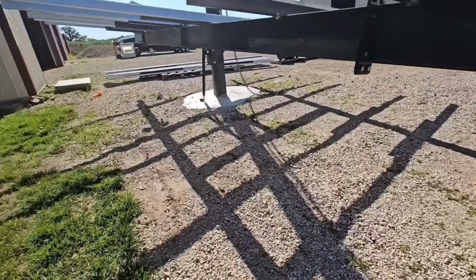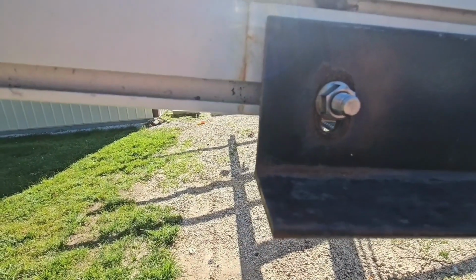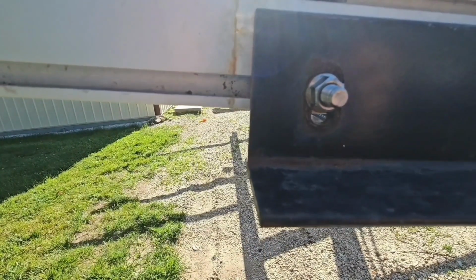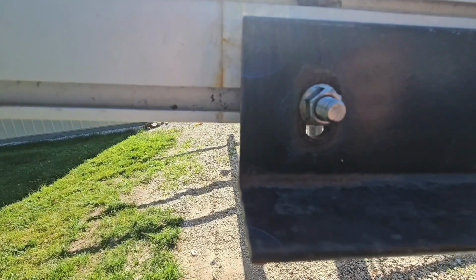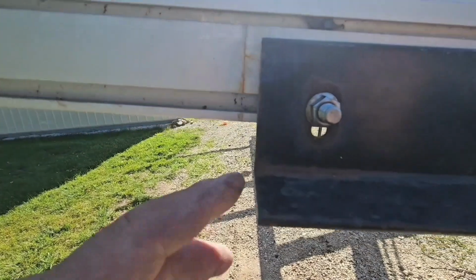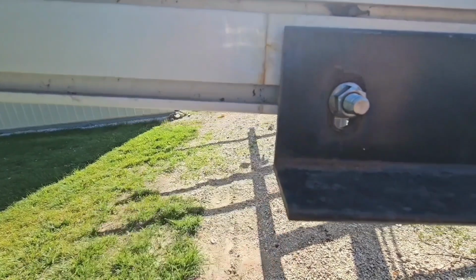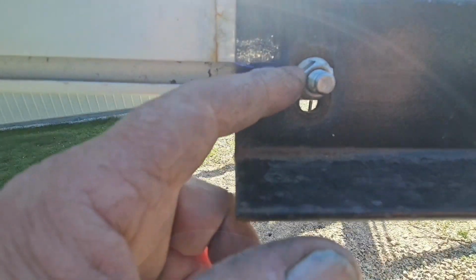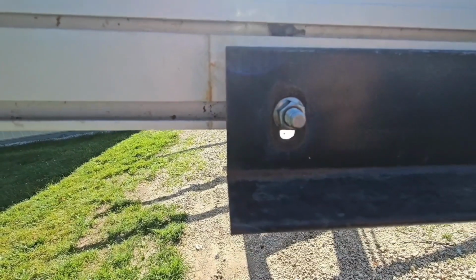On these rails, they run a stainless 3/8 bolt here with a flange nut, and when you go to adjust these, what I've been having trouble with is galling on the threads. So when I had to replace the bolt, I've been using blue Loctite on them. Maybe somebody out there's got a better solution, but yeah, you know, you'll put your mason's line on, start adjusting the elevation here up and down, you know, to get them all lined up, and then you run into where it galls here, and then you end up taking a whole piece off. Sometimes you got to cut the nut off or whatever, or sometimes you can get it loose enough you can slide it all the way out the end, you know. But those bolts, they're galled, they're seized up, they're not going to move.